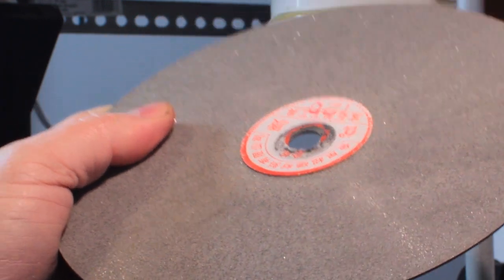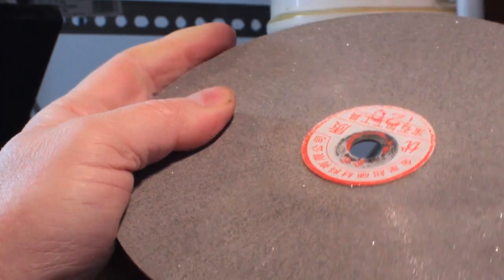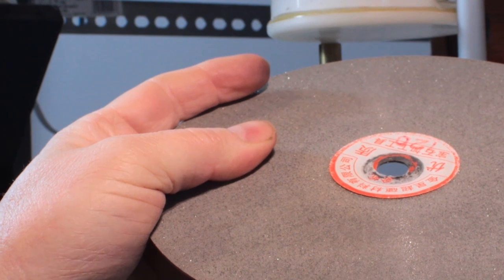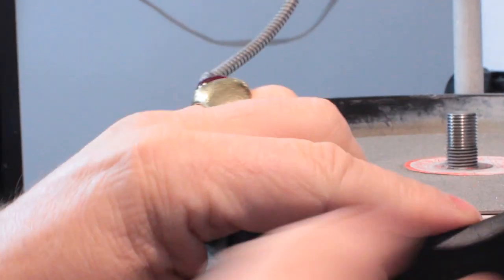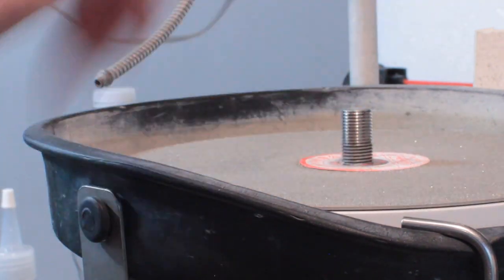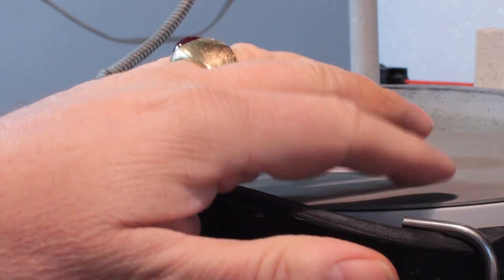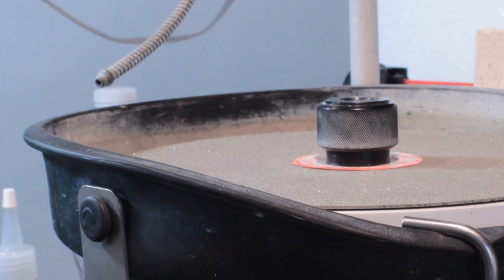Because I have a lot of material to move and corundum is one of the hardest materials there is - not as hard as diamond, but harder than most everything else - I'm going to use a 120 grit topper. Pretty much anything in the 100 series is about the same once it starts wearing out. This lap isn't perfectly flat - it wobbles a little bit when I put it in my machine. I set it on top of my flattest lap; I use my ceramic lap as my master. At the 100 grit level that doesn't make any difference. So now we'll start cutting our Spellbound.